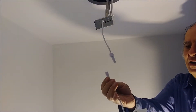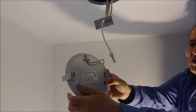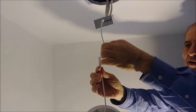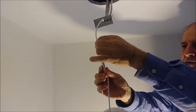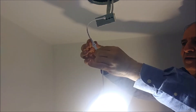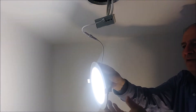I'm taking this LED recessed light — 15 watt, with three options: 3000, 4000, and 5000 Kelvin. It draws 280 milliamps. I'm connecting it to the connector here. There is an arrow — it's very easy, just push it in, and it's already turned on. I lock it with the cover.